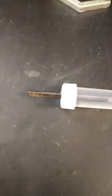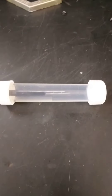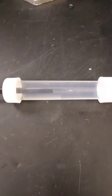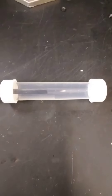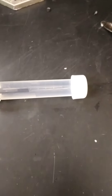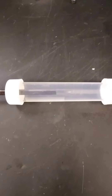For attaching to the graphite electrodes, we build prototype cells — we're studying ionic liquids with zinc and manganese dioxide, and even some copper. In these little makeshift prototype cells, I'll put another graphite electrode at the other end and seal it with hot glue. In between, I'll use a separator of cotton or other materials such as an activated carbon pad.